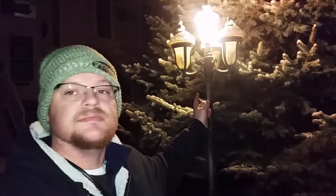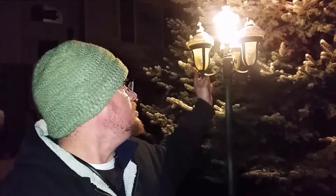Remember when I was talking about how your light bulbs add up? This yard lamp has four light bulbs on it. If you were running four incandescents, that would be 240 watts. If you were running four fluorescents, you'd be around 52 watts. And on LED, roughly 8 watts times four puts you at 32 watts. So there's a considerable amount of wattage savings there.